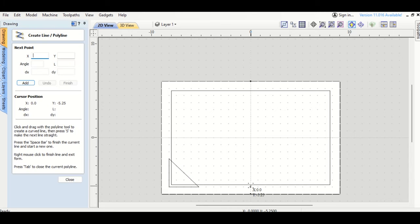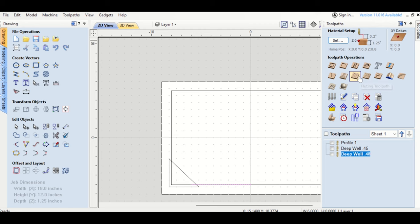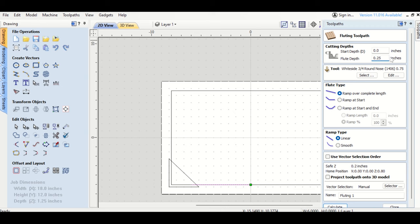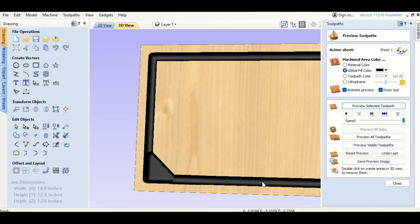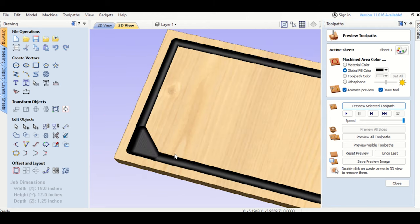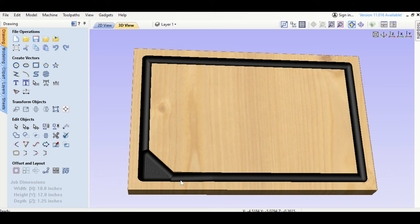In 2D view I add a line, starting right in the middle and coming right in to the well gradually. Then I go to Tool Paths and select the Fluting tool path. It starts at zero depth and goes all the way down to 48 hundredths — my final well depth — using that same bit. Since the area was already carved to 25 hundredths, I want it more gradual. I recommend testing this out; I kept working my way up until it worked perfectly.